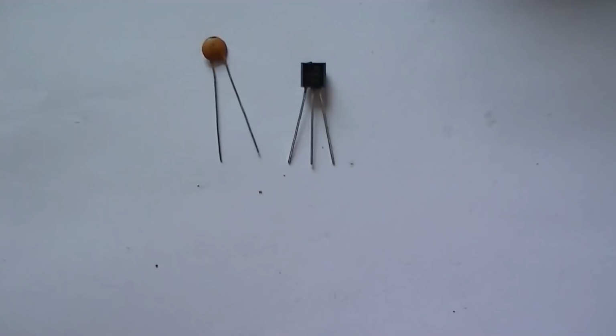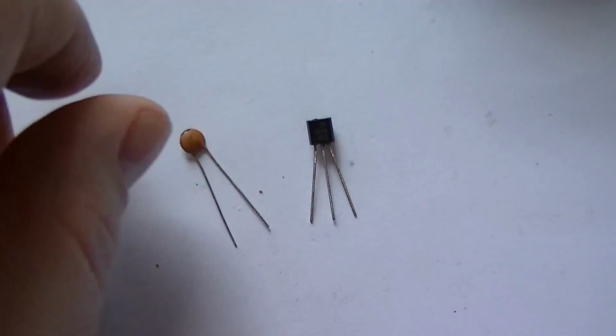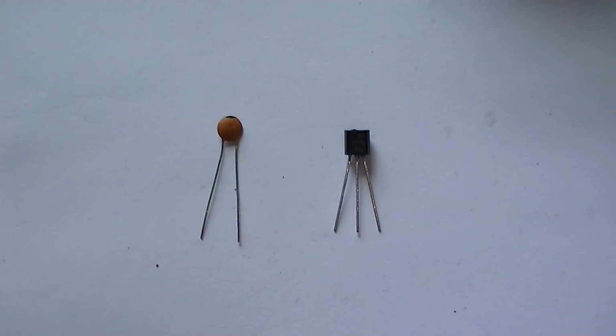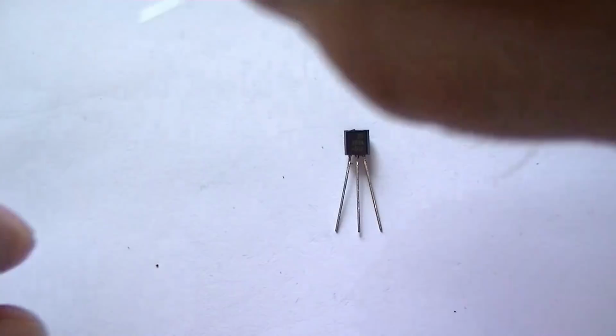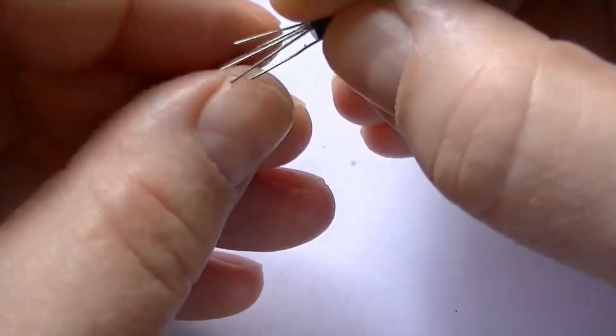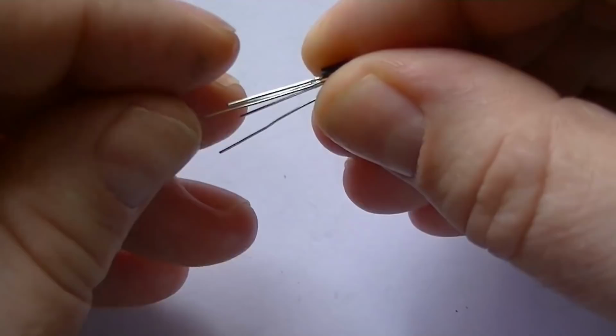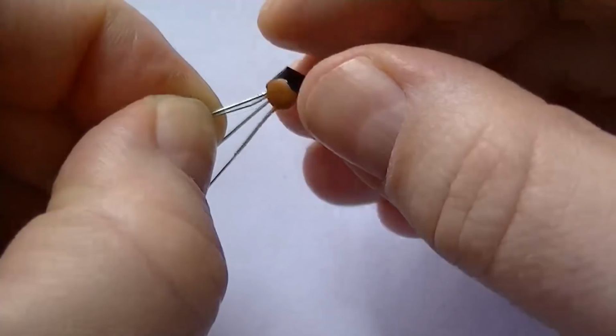Okay, the second transistor is the transistor that's used in the tank circuit. So what we've got here is a 10pF cap, which is C5, that goes across the collector and emitter side of the transistor. Basically this keeps the tank circuit working. It's basically the feedback cap. So this switches the transistor on and off at a very fast rate. We're going to build this to start off at around 100 megahertz. So basically, this will be switching the transistor on and off at 100 million times a second. Quite astonishing, really, isn't it?